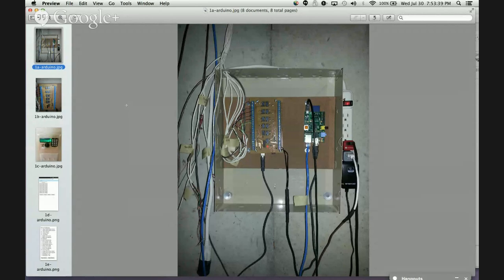Okay, so this is a PCB that I made. This is in my basement. I basically took my existing alarm panel, ripped out the circuit board that was in there, and kept all of the sensors. So I have motion detectors, keypads, an alarm siren, smoke detectors, and door sensors, all wired to this PCB. There's an Arduino sitting underneath here. This is just an Arduino Uno relay shield that I made, and it's connected to my Raspberry Pi via a USB cable.